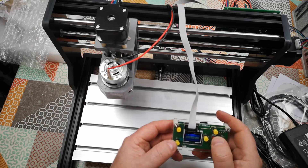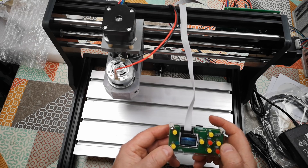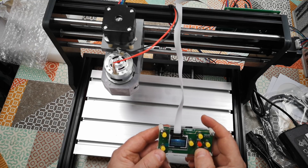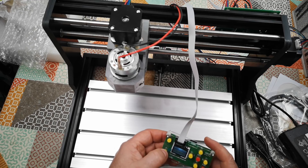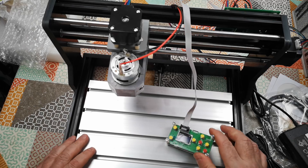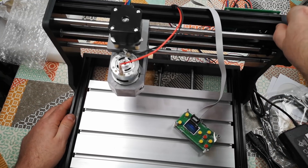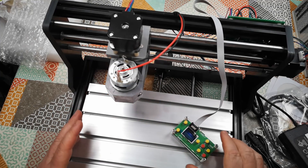Okay, I think I've figured this out. If we go to control, I've got spindle, XY — so I've got some fine adjustments. There are no limit switches, so you're kind of on your own when it comes to how far you move things. If you move them to the limit, you just end up jamming and the motor drops steps. Anyway, I think we've managed to get it together okay, and it feels pretty solid. There's really very little play in any of these parts, so in theory it should be able to do the job.